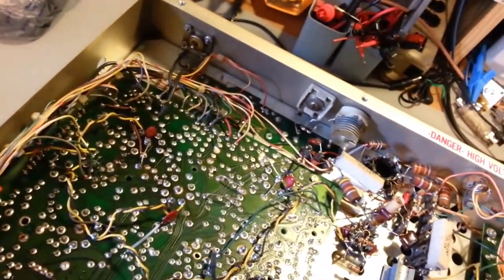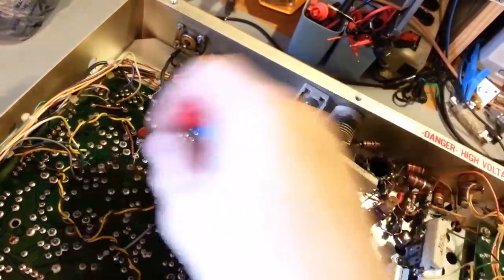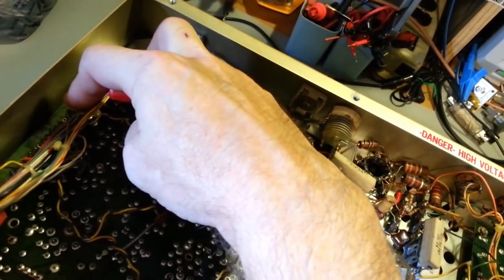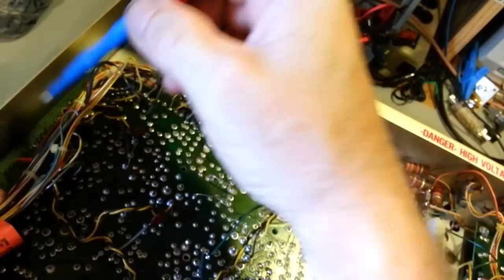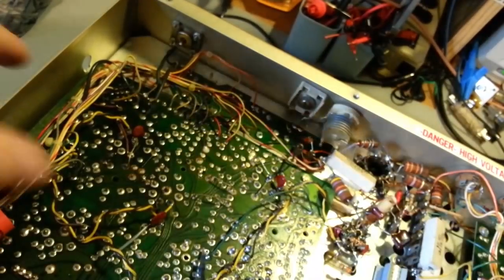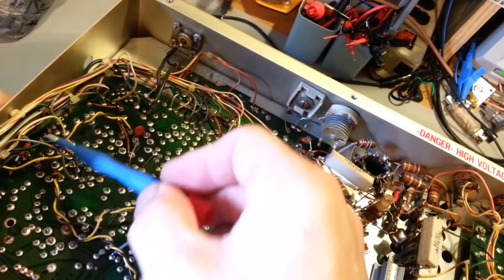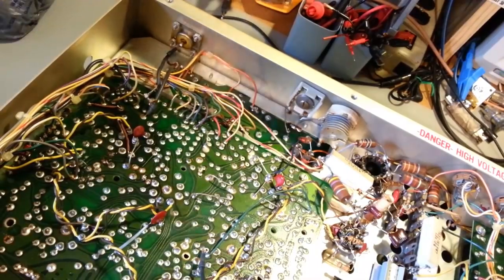And actually the same thing over here. There's another circuit board that stands up on this side of the radio. Just fold these wiring harness gently back so you can get into the pins. Desolder all those pins down in here and resolder all those. That's another common problem point, where all these pins, the solder joints will just break out. But yeah, this looks good.